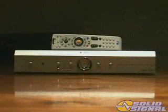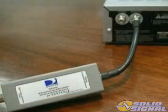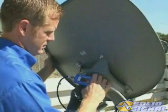In order for your H20 MPEG-4 capable high-definition receiver to receive all the frequencies, you're required to put a B-band converter module in-line at the receiver. Though this ODU is different in some ways, it still works like the traditional DirecTV ODU, so alignment should be no problem. Let's look at the steps in aligning the KA-KU ODU.